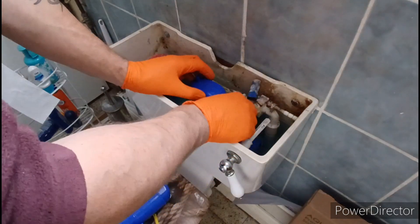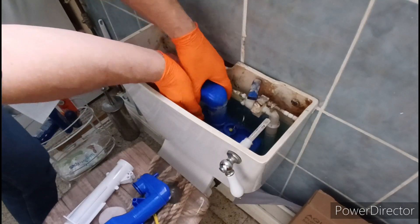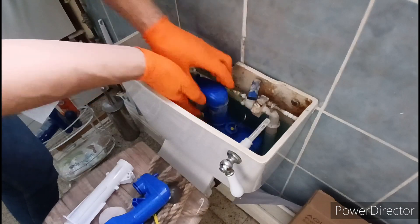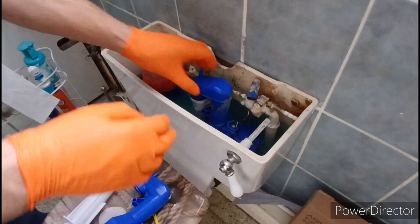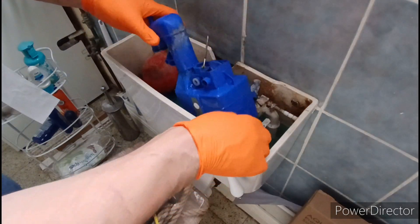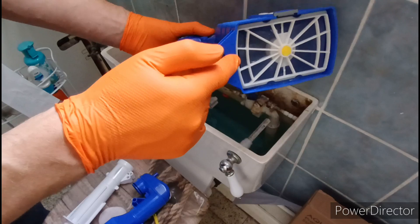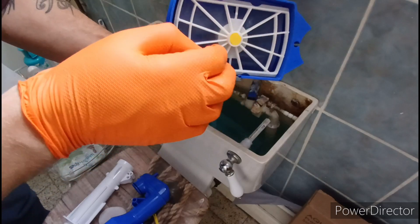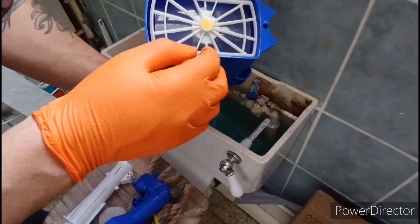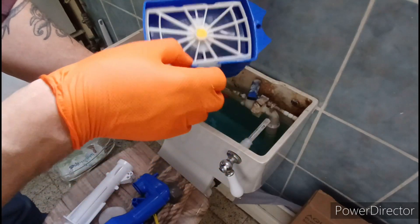Take that arm off. Now — that peg, if you can find it. I've got water coming from this side. Now don't worry at this point, absolutely nothing will leak. You don't have to worry about water going everywhere. Let's see what the problem is. The problem is it's the wrong diaphragm — it doesn't fit. Someone's had a go at fitting it before and fitted a new diaphragm which doesn't actually fit, so that's not going to create enough of a seal for it to work. The other way these can fail is that the diaphragm can just split — all cracked, knackered, bugged — it's gone.